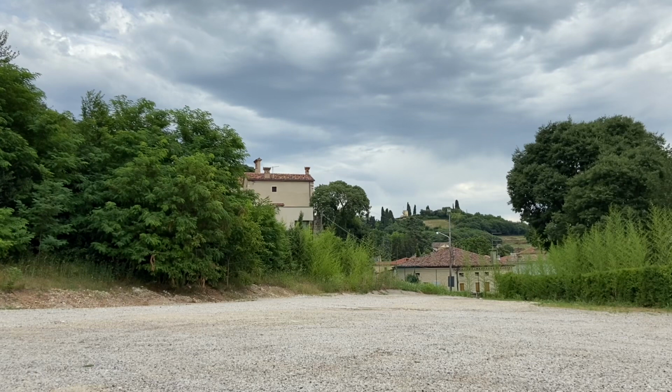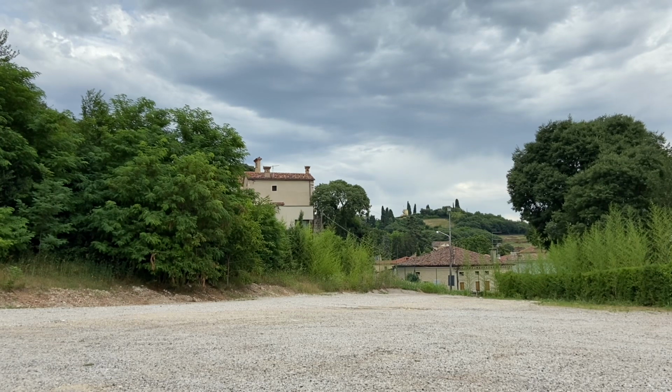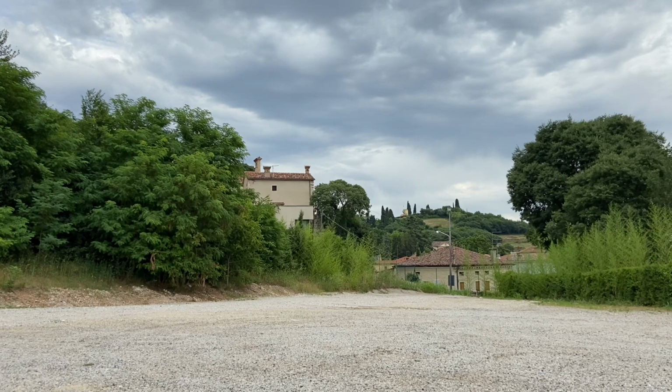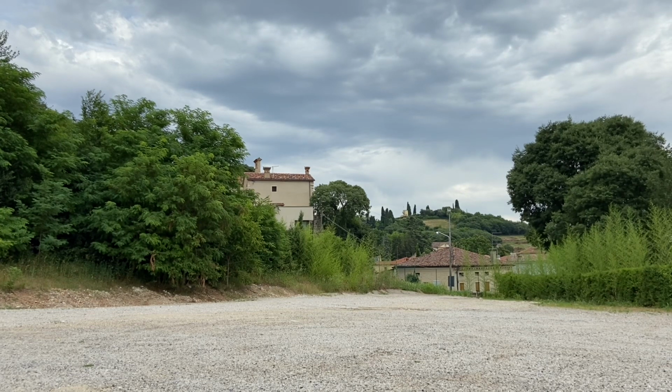Okay, here we go with the 6S on the Stan FPV 2604 1680 kV. And the 4S went pretty well, pretty impressed on stock PID, stock tune. It looked great. So 6S, I hope, can keep up that good trend. So let's see how this goes. Do a quick hover, a punch out, and then we'll transition into flight footage.